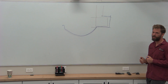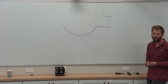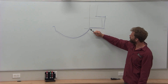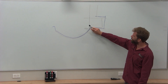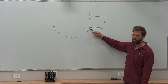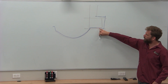How did this double trap happen? By pushing the return box down — that's right. The drain line was pushed down to the floor. Maybe we pushed copper, maybe we didn't, but there were some adjustments made to the drain line. There's not much room below the return box typically, and our chase usually has a 45-degree or 90-degree coming out of the top of that chase. If you have to go around the return box, this section is typically already almost level.